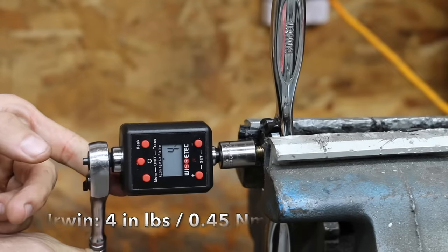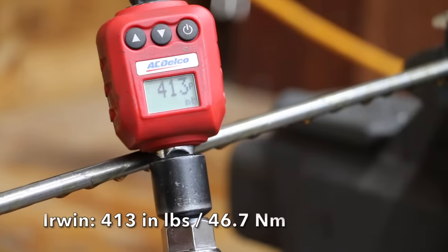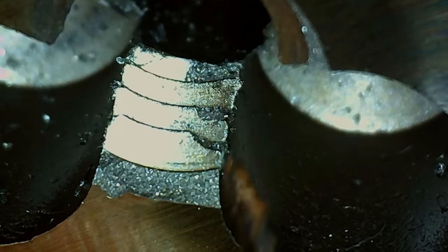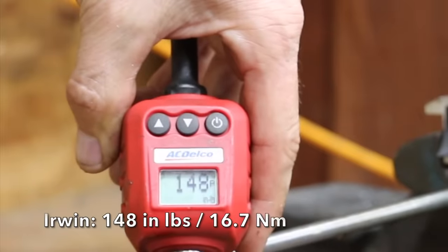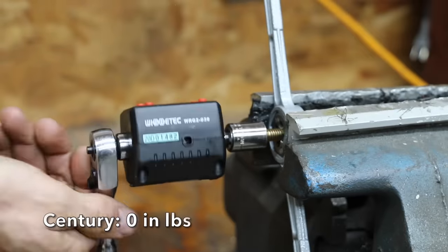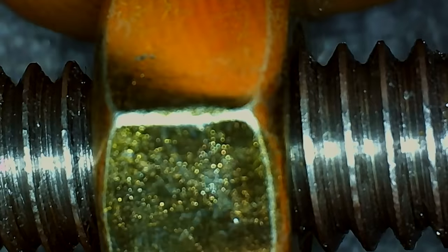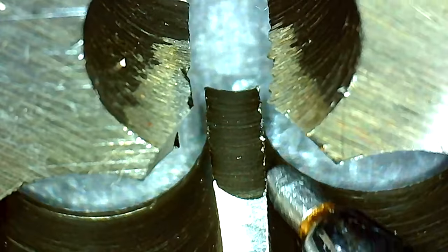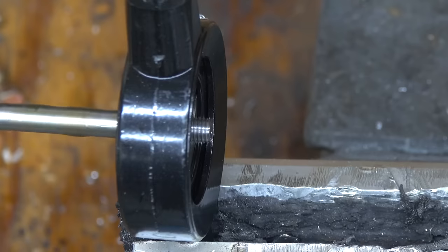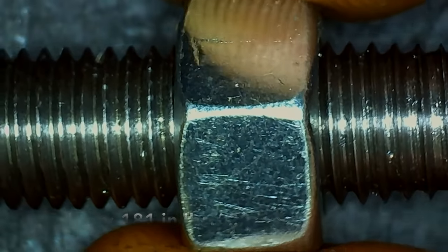The bolt threaded into the Irwin with very little resistance at only 4 inch-pounds, and the zinc plating was not removed. The Irwin started off great but suddenly stopped at 413 inch-pounds after about 2 inches—the die wrench partially blocked chips from escaping on one side, causing buildup and damage to the die. After removing the damaged die from the wrench, I managed to cut another 12 inches of thread before the Irwin gave up at 148 inch-pounds. The Irwin has very little side-to-side movement at 1.9 millimeters compared to 4.71 for the Vermont American. The Sentry survived the entire test with a peak torque of 166 inch-pounds, but has 4.13 millimeters of side-to-side movement and a small amount of visible wear. Unfortunately, the Tecton die with the 18-thread pitch wasn't properly machined, so I tested the 24-thread pitch die instead. The Tecton made it 14.5 inches before stripping out at 181 inch-pounds, with very little side-to-side movement and only a small amount of wear.